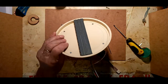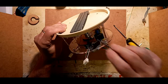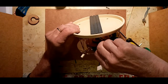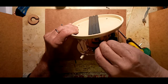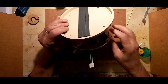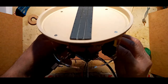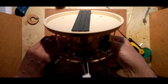And to do that, we tighten that screw, which you can see there, which is the coupling to the shaft. So again, just check that's lined up, that's lined up. And just nip him in position. If you've got T-handle keys, it obviously is a lot better. Nip him there. And obviously what I forgot to say is you've got to make sure that the slot for the optocoupler, there we are, also has got to line up with the opto. And then the turntable wants to line up with the two dead spots. So that's all in line with each other now.